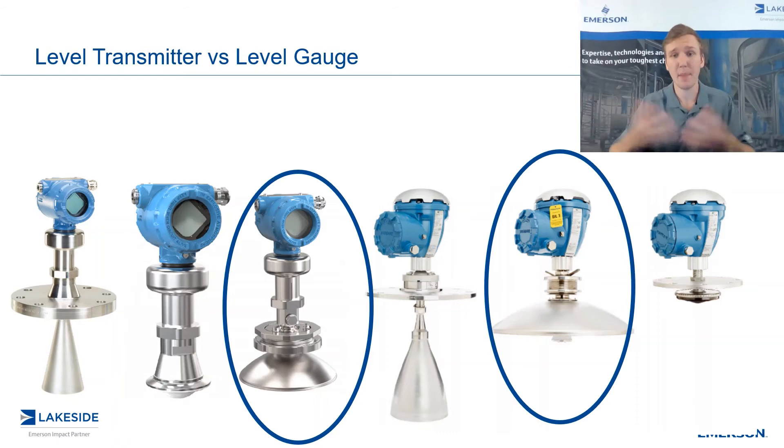When we take a look at the parabolic antenna in both cases, it's clear that our tank gauge antenna is two times the size of our level transmitter antenna. This is very important because when it comes to parabolic antennas, the greater the size, the greater the strength of the reflected signal. This improves the accuracy for our level gauge compared to our level transmitter.